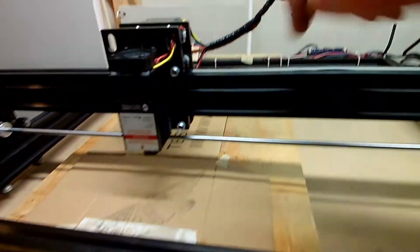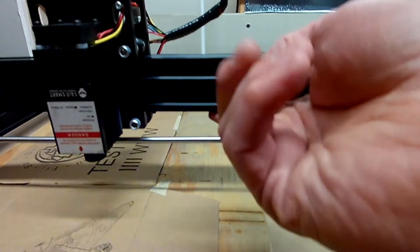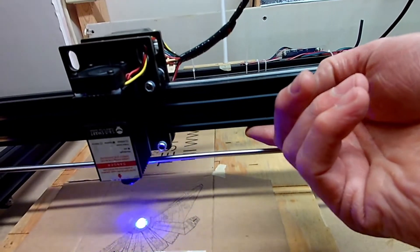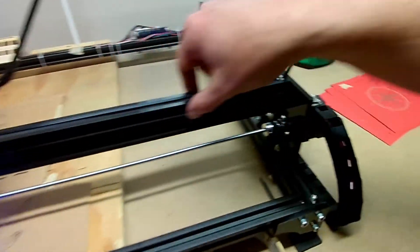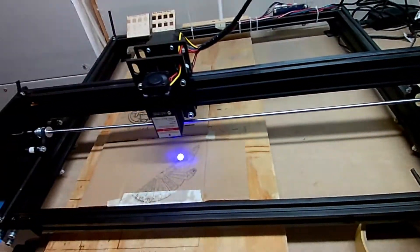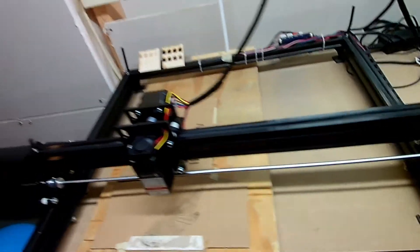The other thing I've done — you'll notice the gantry here. Underneath, I put a piece of electrician's tape across one side. I did have both sides and that squared up. This bar that moves in the y-axis — I made sure that the frame was square, and it is. The bar was just slightly out of square, so I squared that up.